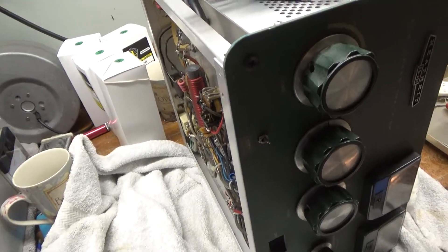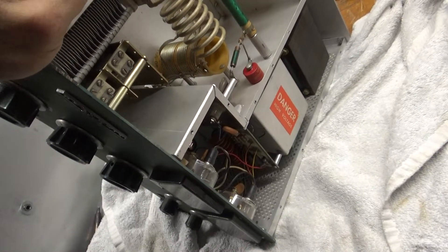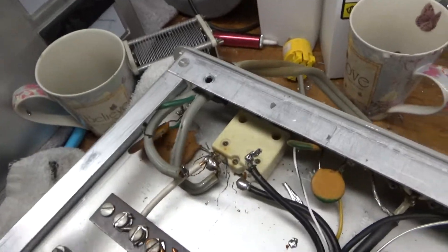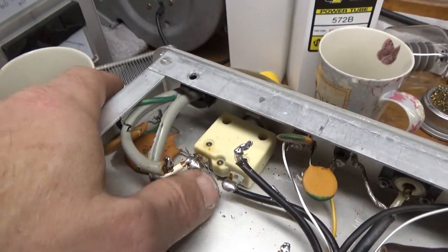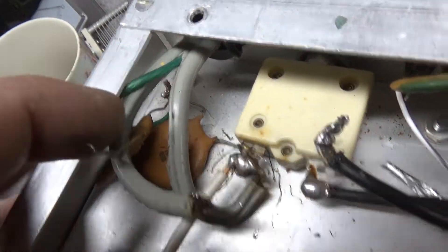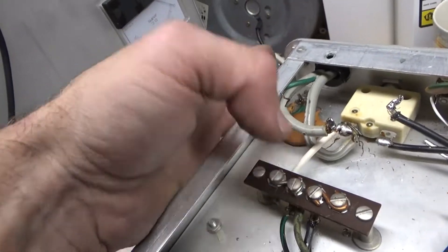A lot of work, a lot of stuff to do. Also needs a fan. I'll show you segments here and there. So, I had the breaker in — the contacts were almost touching the surface. Sloppy, sloppy solder work. Had a solid lead on this breaker above and it wasn't even connected. The lead on the .01 cap is almost touching the chassis, so I'm going to undo this and put some heat shrink on that, re-solder it, and run new leads from the breakers over to the terminal strip.